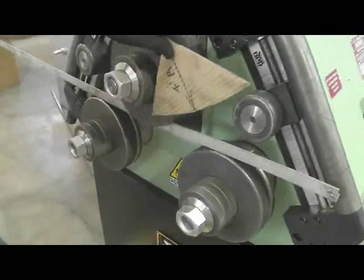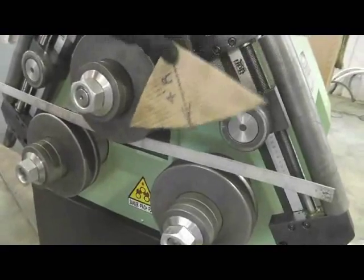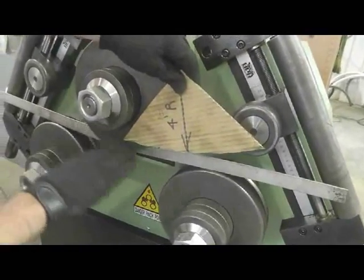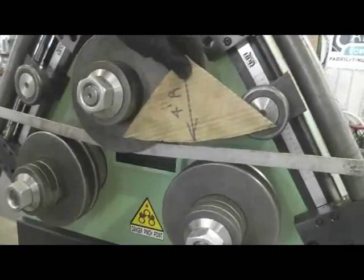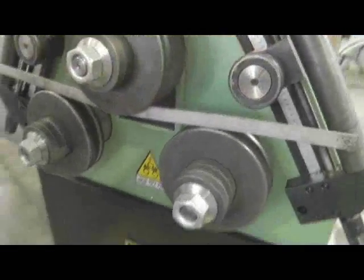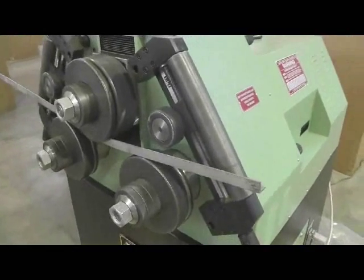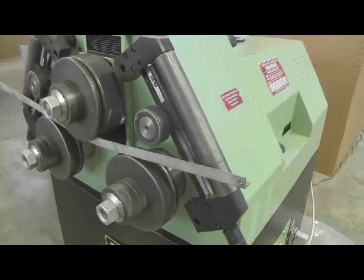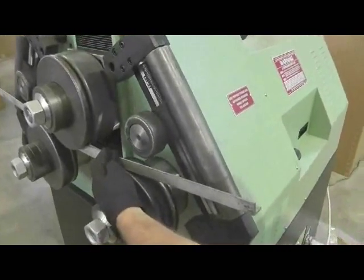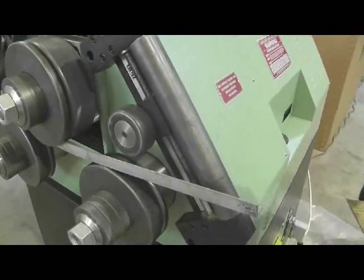Let's bend the profile. I have my radius gauge. This first adjustment is a guesstimate — I'm just looking at the deflection underneath the top roll. I want an inside radius, so I'm looking at the deflection of the part. When I think that's close enough, I'll start to roll this material through. Now I've got some unbent straight which I want to roll through. This first part will be dropped because I can't control the part until I capture it with my cam rollers, but I'll move this down.